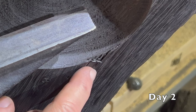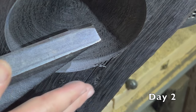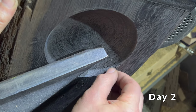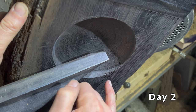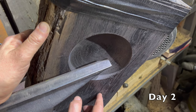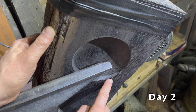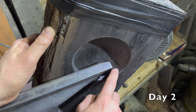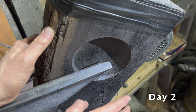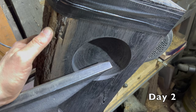Got a nice curve to it. Now, this crack down here runs this way — when the whole piece gets sanded it's going to strip all that back anyway. But when I'm pouring the resin, the resin is going to come down here, run along this channel, and go straight into my bowl. So I'm going to put some super glue and dust in this and build it up so there's a barrier there — I'll do that before I do any sanding. It's a little bit rough with tools at the moment.